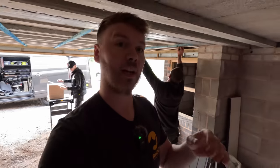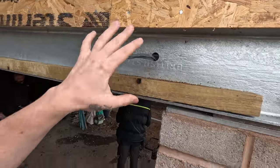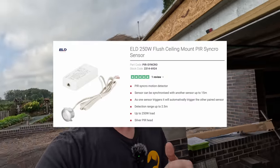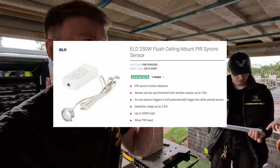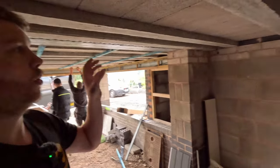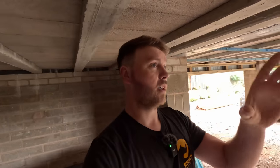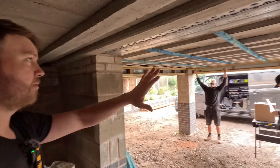It's all being punched through here - you can see we've got a rod there. There's going to be a big ad box put in because it's just going to be like a storage area garage underneath, which is a bit limited on height for tall people, but that's going to allow us to put all of the drivers in for both sides. We're also going to be running soffit PIRs - IP-rated PIRs - that are going to sit in the outside box. We're going to use the 12-volt stuff that'll run back. I'll put a picture on screen now of what we're going to use for the sensors. We'll splice that, which will allow us to put the PIR transformer in the box as well, so if we ever have any issues we can pull the PIRs out, there'll be a little Wago connector, we can put a new one in. If the box itself is broken it can be changed there - so we've got a maintenance panel to access everything. Once this is up it's sealed, it's done.